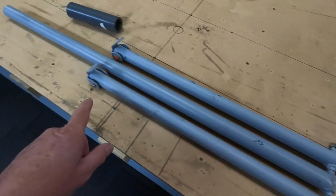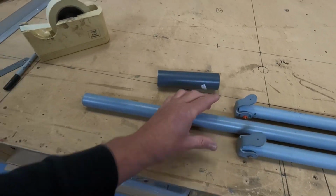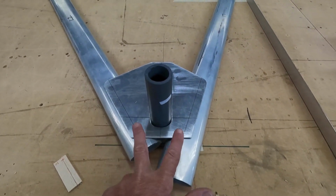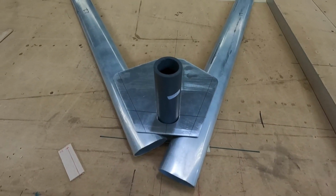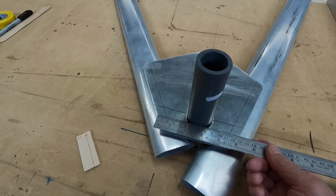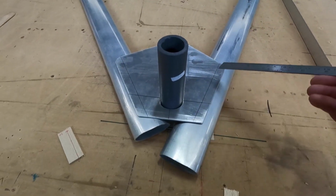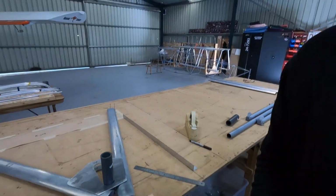but the consideration there, if you call that 100 mil, come over here, 100 mil, and you only just snick these. So you want to spread them out a little bit more. So I'm going to aim to spread those out to about, well, it looks about 120 mil, if that makes sense. I've given myself 15 mil edge distance. So anyway, talking to myself there, guys.